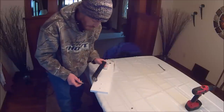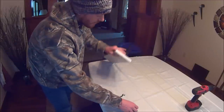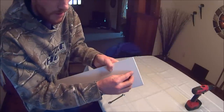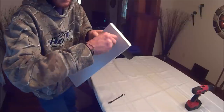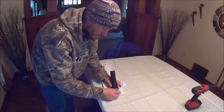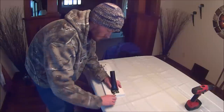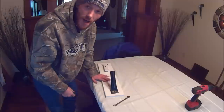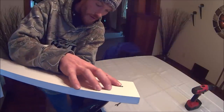What I found works best is using a quarter-twenty bolt and a one and a half inch stainless steel washer. You put your bolt on there and on the back side the bolt sits flush with the board — that's what the countersinking is for. Once you get the nut started in there, screw it down as best you can, center the conduit, and take your 7/16ths wrench to tighten up the bolt. You can put a drop of Loctite in the threads on the bottom side and the nut goes right into the countersink flush.